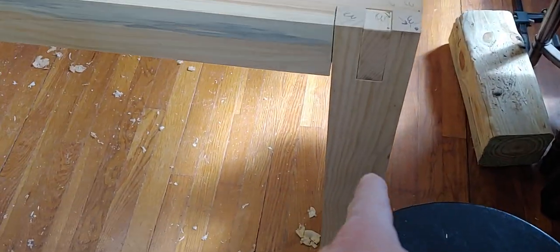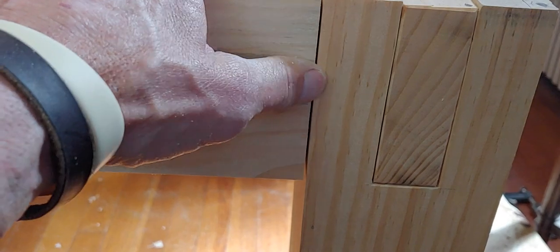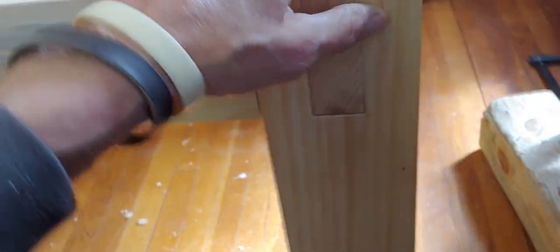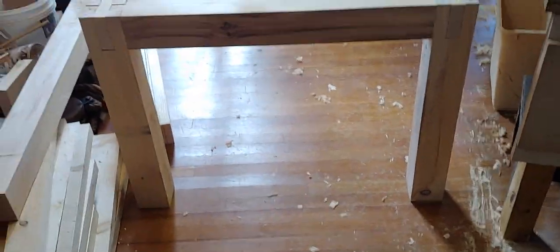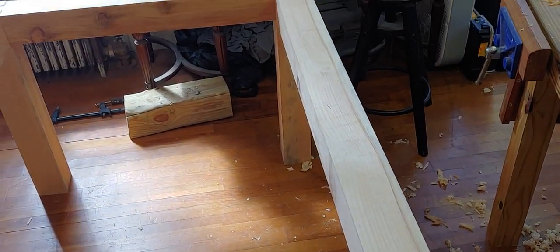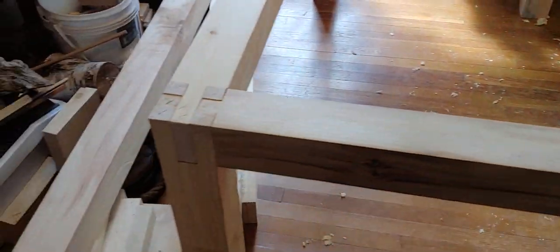This would actually be okay just the way it is. I haven't done any finish sanding or planing on the legs yet - I'll take a look to see if any of them are flush or proud. This one's just the smallest bit proud right here, so I'll face this side a little bit. But I just want to do a test fit - it takes up the whole shop as you can see. You can see my footprints on it - I just walked down that stretcher with my full weight, nothing holding it in the middle, and you can't wiggle it. It's crazy solid.